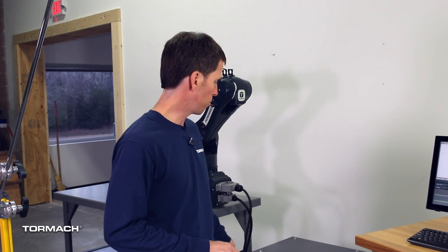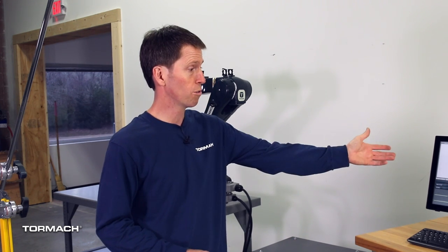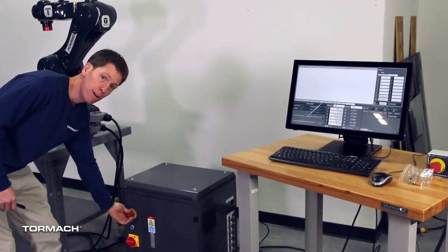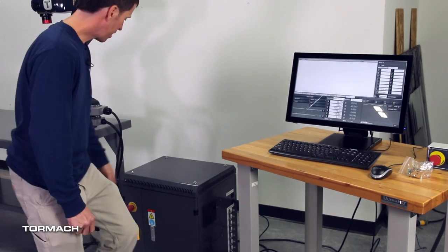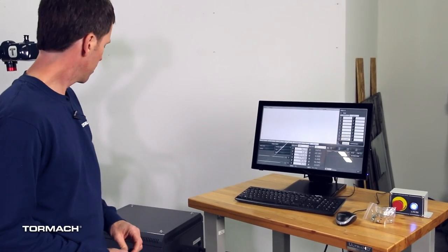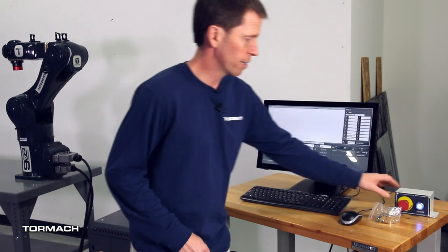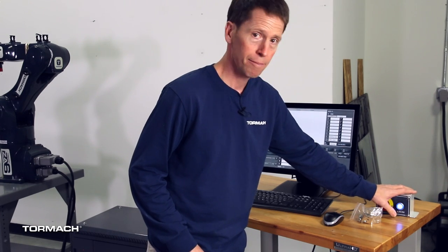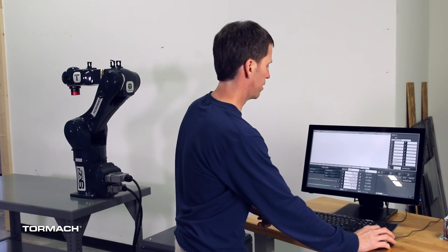To power on a system installed with a functioning safety input: turn the rotary disconnect on the electrical cabinet to the on position to power up the drives and apply power to the control computer. Launch the control software. When the control software is up and running, take the machine out of e-stop by making sure both the auxiliary e-stop and the primary e-stop are in the out position, then press either blue reset button. If the button stays illuminated, you know both e-stops are out. The last step is to establish communication between the control software and the robot by clicking the flashing reset button on the screen.